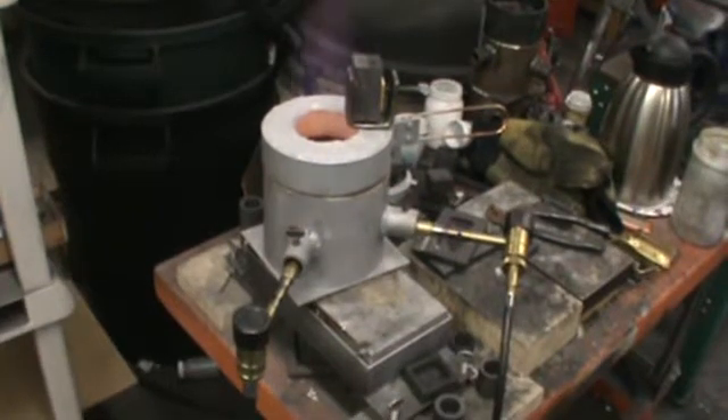I'll set the mold right up on top where it's in the exhaust gases. Being an old guy, I got to keep my head straight — I don't just reach over bare-handed and grab that. I actually do have my gloves out today. While I'm waiting for the silver to melt, I'll just go ahead and put that. I'm not really preheating it because I'm trying to just pour them the way a lot of people do without preheating the mold. Preheating really helps when you're doing the engraved mold. So anyway, it's going to be a while.